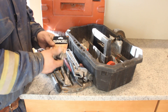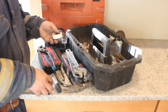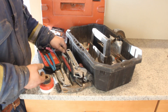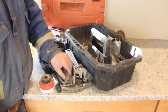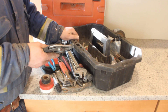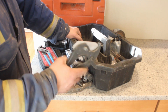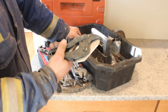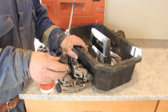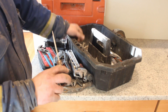We have a 9-volt battery for our testers and things. I have some tape — I had it out for another job. I have some Teflon tape because I was doing some things that needed it. Another adjustable wrench for tightening and loosening things. We have a PVC cutter — sometimes when you're working with PVC, doing a pool or an underground feed to a garage, it's nice to have. You just snip to where you want it; you don't need your hacksaw. There's also a thinner cabinet screwdriver because there are bus bars and screws that need a smaller straight head than the one you normally carry.